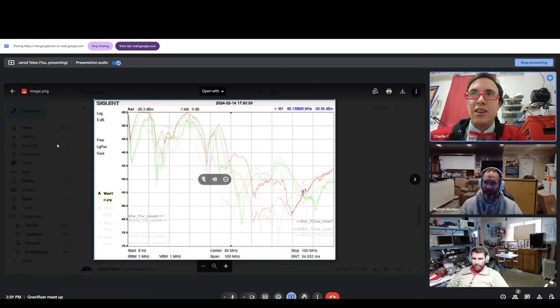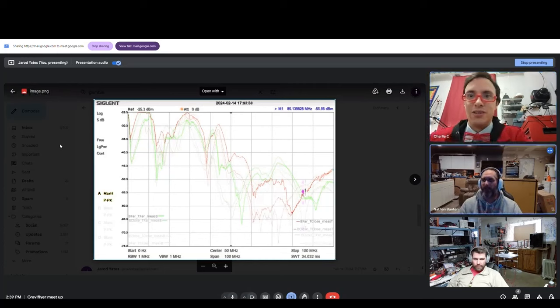The C44 is awful and never should have been built. The TV transistors ripped from tube TVs — they're used to driving a flyback so you get a lot more voltage out of them. That probably explains why we're popping those things all the time and he's not. I used one of those before on a very short coil — I wanted to get the frequency a lot lower, and it worked out perfectly, stayed resonating well.